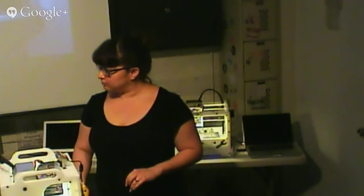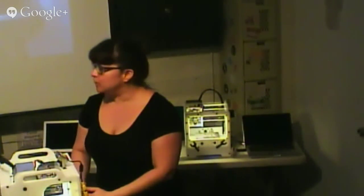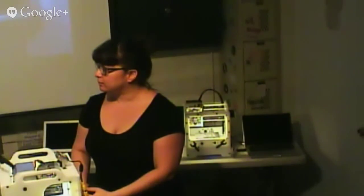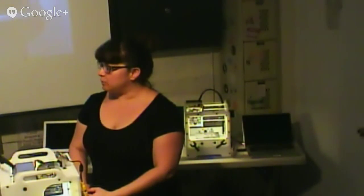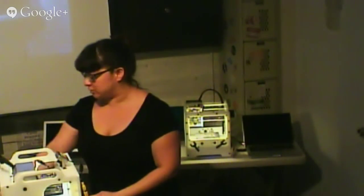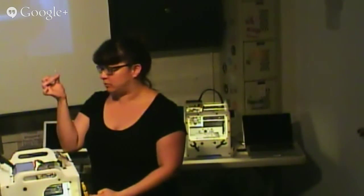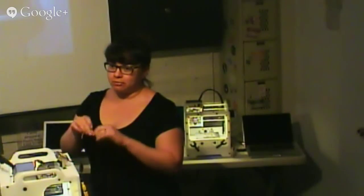Oh, the software. But the question is, partly, is there plated metal in the hole? And so you have a way of getting actual plated metal on the hole? Not right now. There are many ways of doing it. Right now, what we do is if we need a little bit of metal to make contact with both sides of the board, you run a little wire through it. So you have to hand thread your wire through your vias.